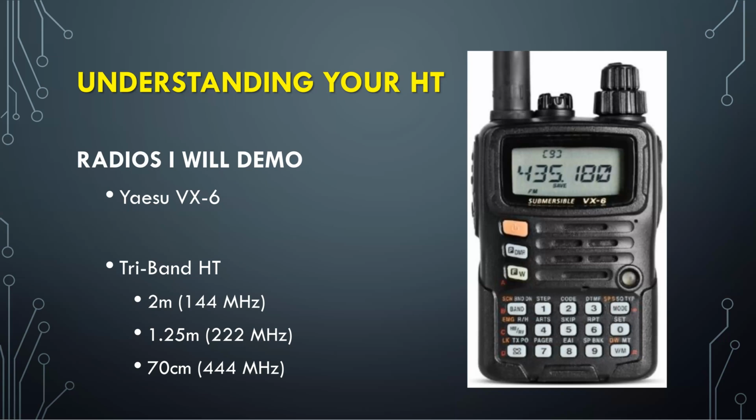Okay. And even with the HF band, the high frequency stuff that we learn when you get your general license, we talk about the 40 meter band and the 80 meter band, 160 meter band. Those are rounded up or rounded down numbers. Okay. They just describe the area of the ham radio bands that we're using. So each radio wave has a wavelength, how long the wave is, and has a frequency, how many times it does its jiggle dance per second. Okay, that is the frequency.